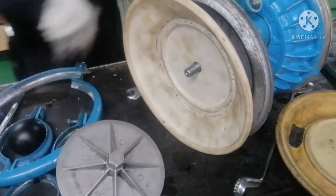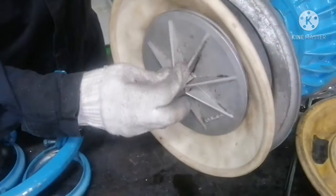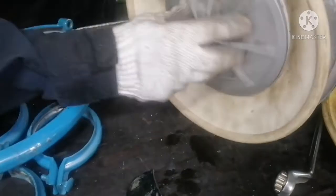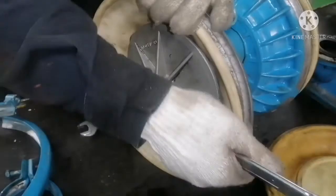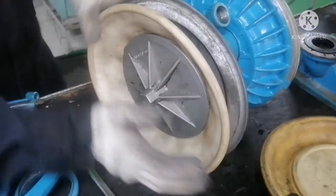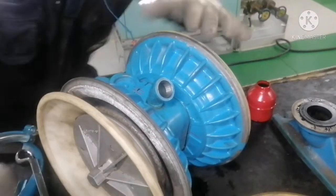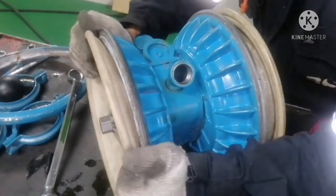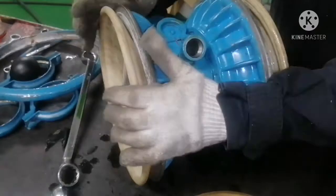Now I put back. Always ensure you have to put anti-seize on any kind of bolts whichever you are doing work with. You can see this groove should match with the other groove. See the movement should be free. That means the duplication is proper and your movement for the diaphragm is good. There is no restriction in movement — this is one check you need to do when you are boxing up. It should not be restricted anywhere.